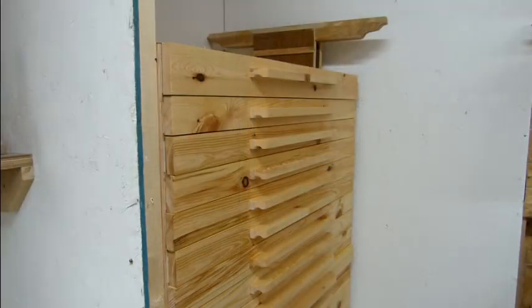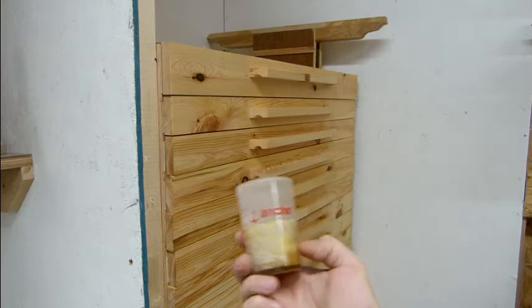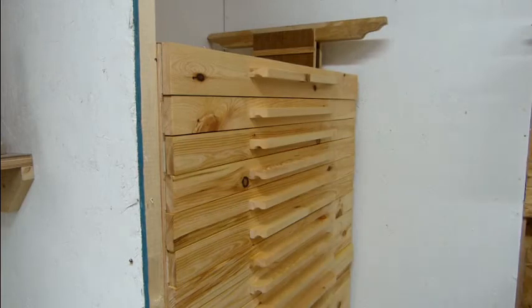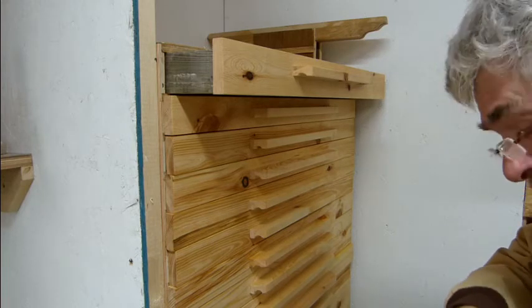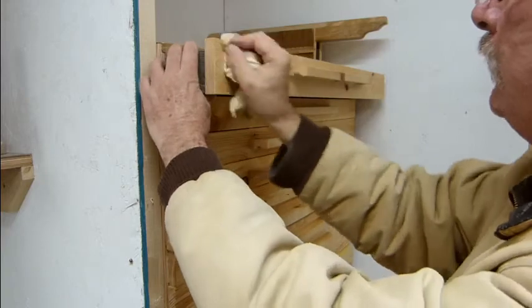All right, like all great plans of mice and men, my finishing routine went awry. I put a coat on, and then 2 days later, I put another coat on. And now it's about a week later. And life got in the way, and I got busy. So what I have here is, that was about that full of paste wax and oil mix. And I filled it up with a little bit more boiled linseed oil and put some beeswax in it, so it's just soft wax of some sort or another. And I think I'm just going to finish off with that on it.